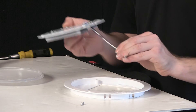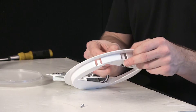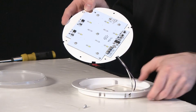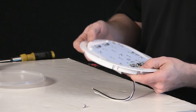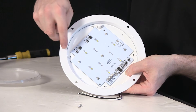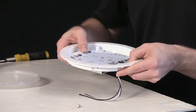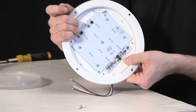For putting it back together, go ahead and take the wiring harness, route it through the hole in the polycarbonate housing, align the tabs on the housing with the insets — it drops right into place. There's an alignment tab here and here, and also a tab where the mount screw for the optic dome goes through. Go ahead and take the four screws that were removed initially.